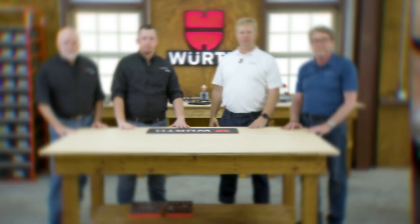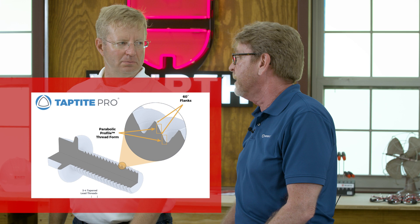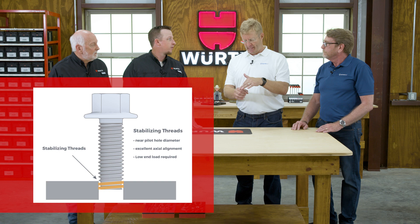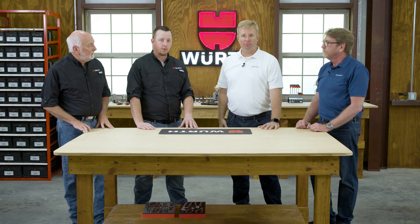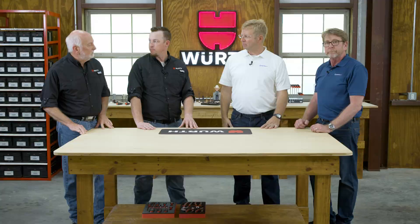In conclusion: TapTite Pro thread design is able to create tensile stress equivalent to a bolt application. With the new parabolic thread, we're able to create a stronger nut member, which means we're not going to strip the fastener with a standard depth of engagement. Another added benefit: major reduction in no-starts. The stabilizing thread ensures proper alignment and minimizes the possibility of no-start. We have heat treatment options — CoreFlex N and CoreFlex I — that address the problems with case hardening in certain materials, so we can get into any material with the right heat treatment. Some of the leading automotive manufacturers in the world have chosen TapTite Pro as their grounding screw of choice.